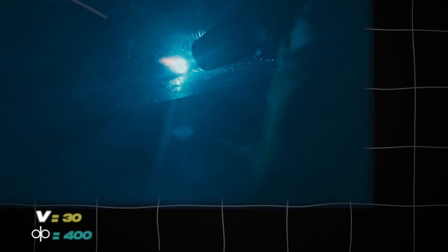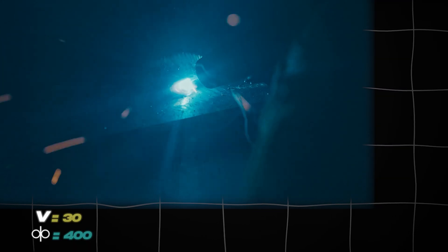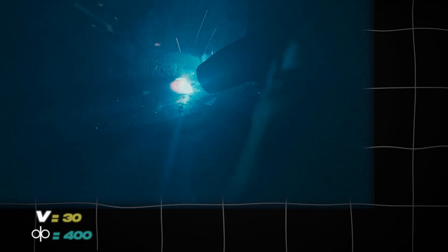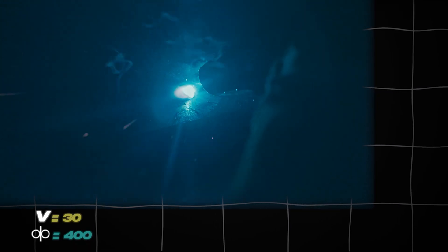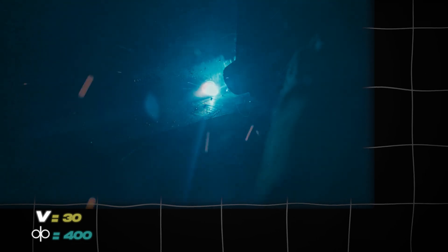There she goes — that's what I'm looking for. That consistent buzzing sound. I can really see that puddle wetting into the top and bottom plate. As I do my cursive E's, really washing that puddle into the top and bottom plate.